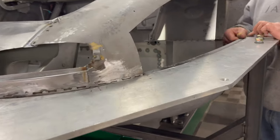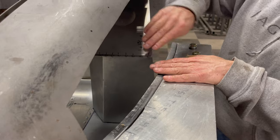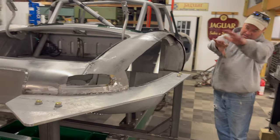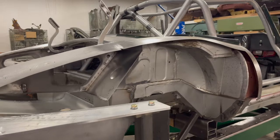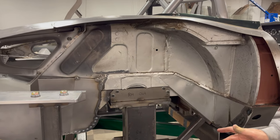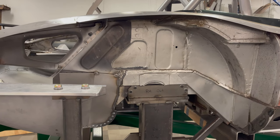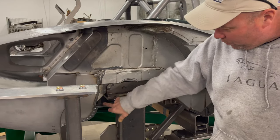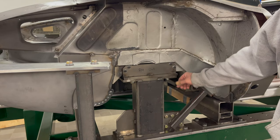On this side it's a little springy outward, so it's tight up against here — it wants to go that way like another eighth of an inch. But we've taken a little measurement there and we'll set that when I'm filling this all in. What we've got to do now is unbolt it. The tail jigs are just sitting there, but it is bolted down in these front and rear towers. If you remember, it fit into the front towers and that left-hand rear beautifully. You can go back to an earlier episode — I think it was part five — where we aligned this. We had to pull that way and pull this way and we put a shim in the roll cage here. And when we had it all said and done, we were just right in this back corner here.